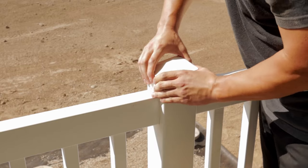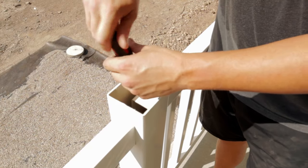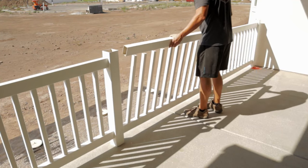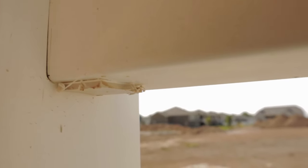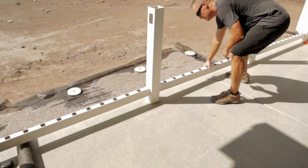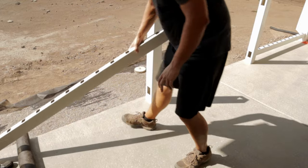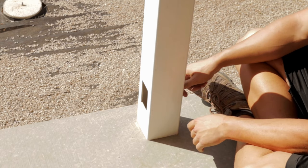The caps on the railing are glued down but can easily be popped off. Once inside the post, a wood screw is used to hold the rail into the post — this is common practice on securing rails to a vinyl post. Once removed you can start dismantling the railing. Because you can't get into the post to mount the bottom rail with a screw, a piece of vinyl was glued to the bottom to hold it in place. From there I have access to the pressure bolt and just unscrew the nut on the top.